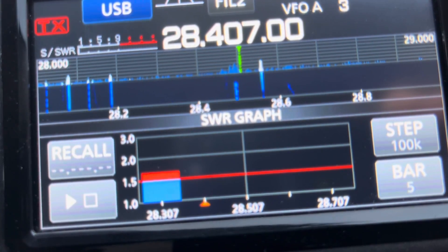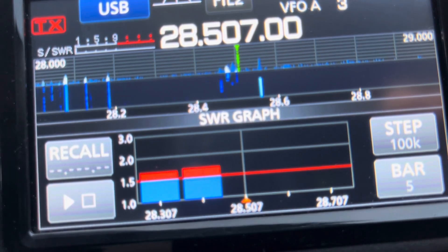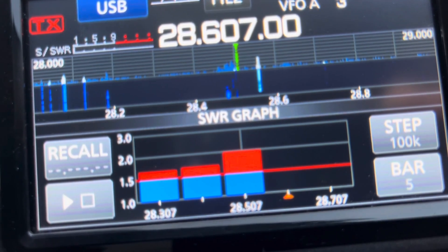Finally, 10 metres. The antenna works as a full-wave on 10 metres. You can see here on the tuning what our SWR curve was like — again, not as good a match as we had at home, but perfectly usable, and you can engage a tuner if you wish. If you put the antenna away from the bodywork of the vehicle, you'd get a better match — more lessons learned there. 10 metres itself was very quiet, but I'm glad to say I did manage to make a couple of DX contacts, one of which I captured on camera, and here it is.